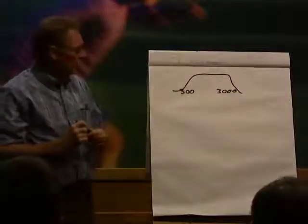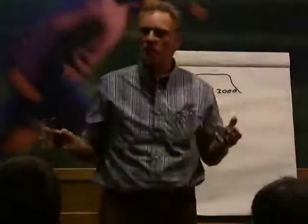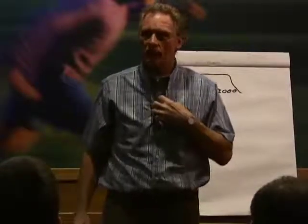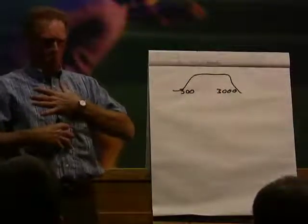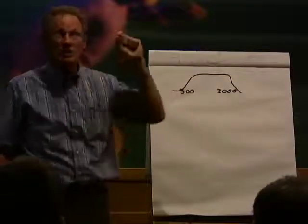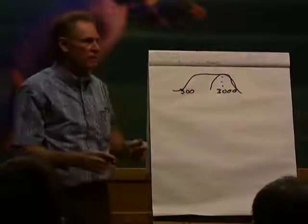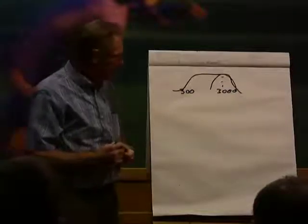Below 300 — okay, let me do a test right now. Hello, testing, one, two, three. You can still understand what I'm saying, but you didn't know who was talking. That deep male voice only serves to identify who's talking. The intelligence you need to understand speech is in the higher frequencies. That's the problem when you get older and lose the higher frequencies — that makes it so hard to understand anything, because those are gone or lower.